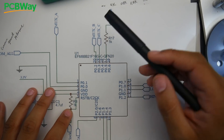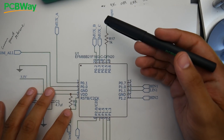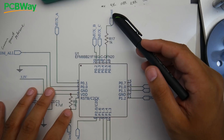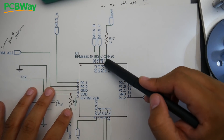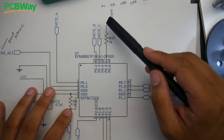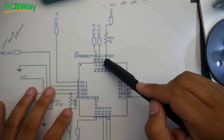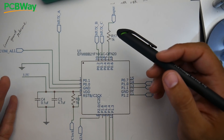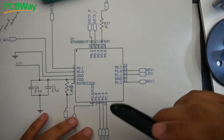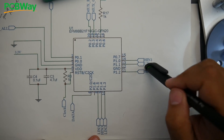Let's start with the input pin, which is very important because it tells the ESC what speed the motor should be at. This would be the D-Shot input, PWM input, Multishot, or Oneshot input. Consider this a pad — it'll go through a 1k resistor and reach the microcontroller unit, which tells the ESC how fast the motor should be spinning.